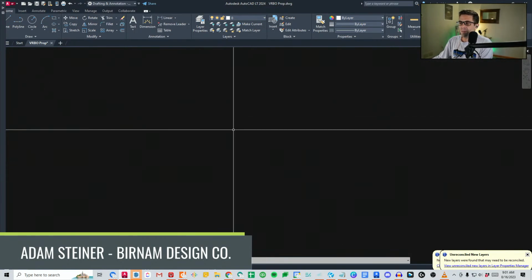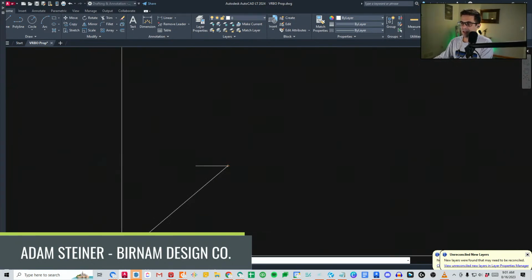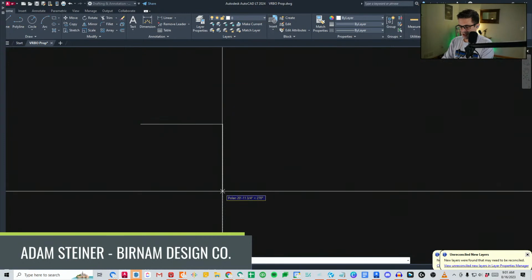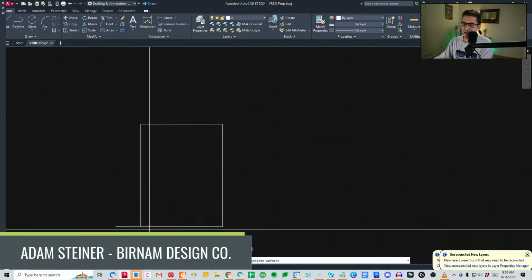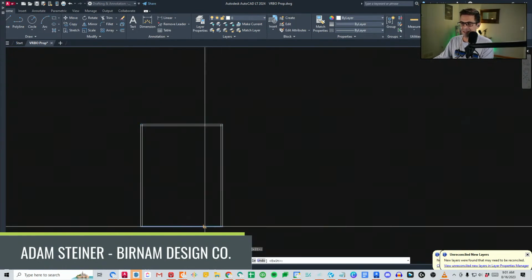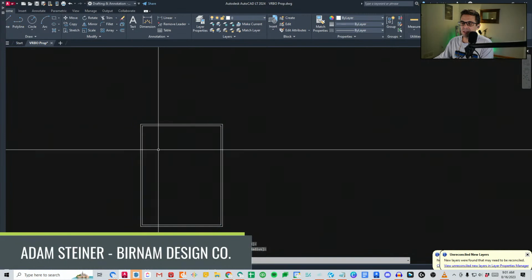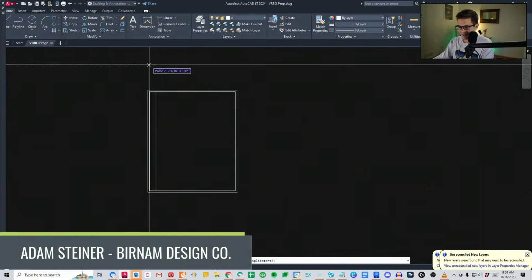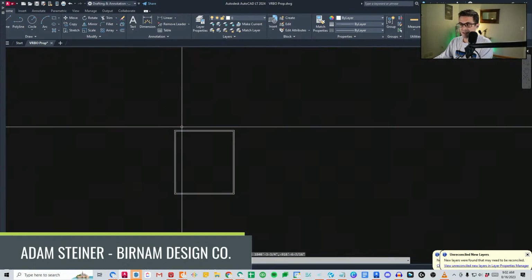Okay, for a plan like this, I know for a garage it needs to be at least 24 feet deep, exterior to exterior, to feel really nice on the inside. I've done smaller than that, but usually for people with smaller cars or more budget plans. But this is a workshop somebody's going to be building in their backyard, like an accessory structure, maybe an ADU plan. So let's go a little bigger than that. Let's go 28 feet, dare I say, and then maybe 36.